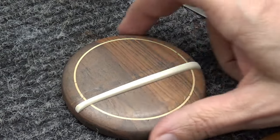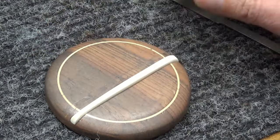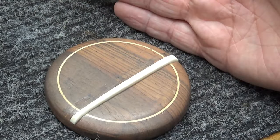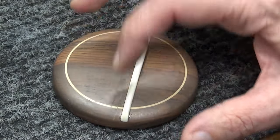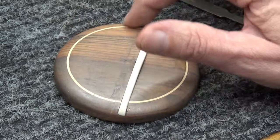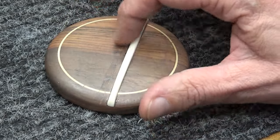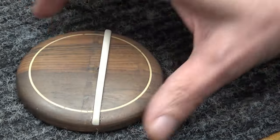I guess the whole reason I got the lacquer out and wanted to spray that is because that old urethane had gotten all milky over the years. And this had this really brilliant orangish red color. It was really rich. It looked beautiful, but it looked really out of place on the guitar. And using those opaque brown and white pigments really helped camouflage this fake wood grain that I painted in. So I'm glad I did it.